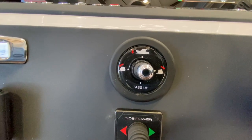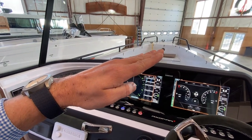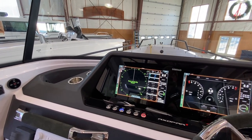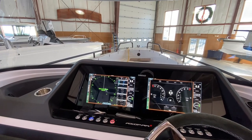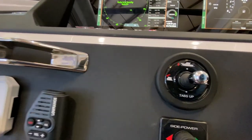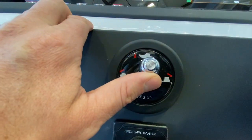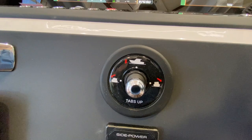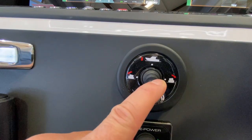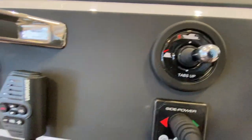The more bow-down attitude you have, the greater the waterline length on the boat, because as you put the trim tabs down the bow goes down, introducing more bow into the water. The way these bows are shaped on the Axopars, you're introducing a knife-like bow shape forward, which does a really nice job calming the boat down. So the more trim tab you introduce, by definition, the calmer the boat gets — you're always adjusting based on comfort level and sea conditions.